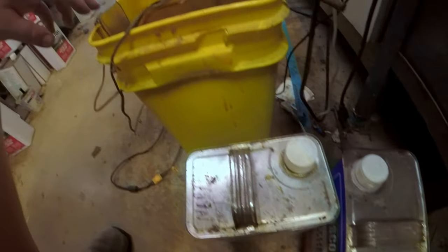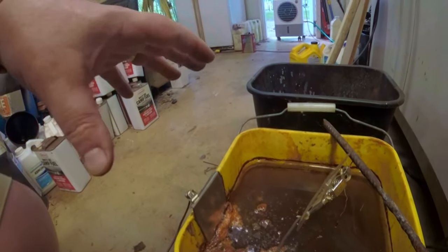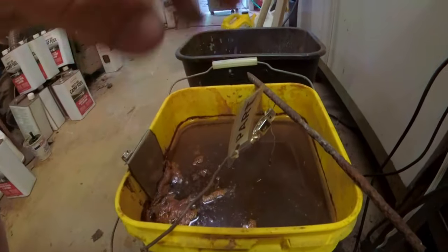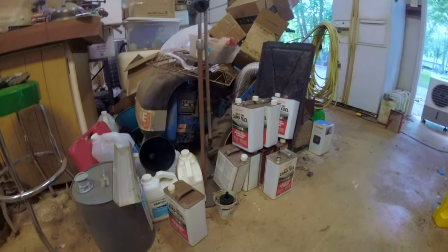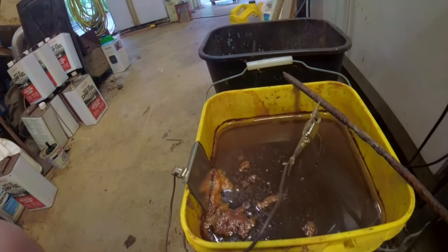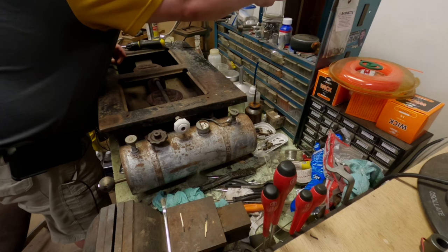For my sacrificial electrodes I use pieces of metal cut from old fuel cans. The wide surface area is what works — people say use rebar, but rebar has a very small surface area. These fuel can pieces have a big wide surface area and come free. They're thin so they don't last real long, but since I've already bought them they're pretty much free, so that is the story on that.